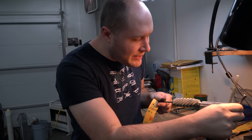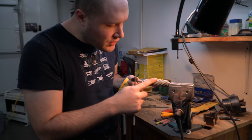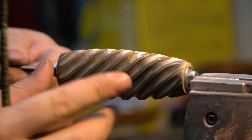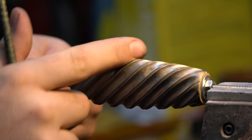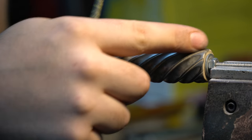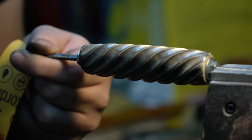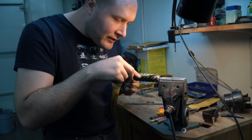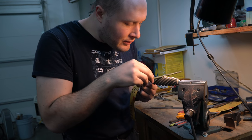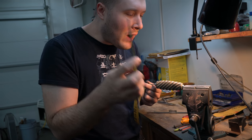And the reason I need it tapered is because these flutes across here are really narrow, but because this handle isn't perfectly round, the flutes actually open up on the edges and get really wide and then they go back narrow again and get real narrow at the ends. So I need a tapered stick to get in there. I'll sand on the narrow spots and use the wider area where it opens up.